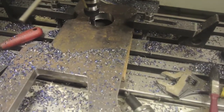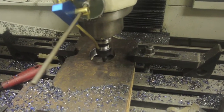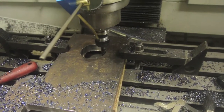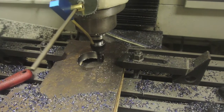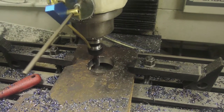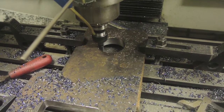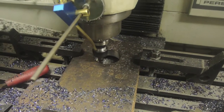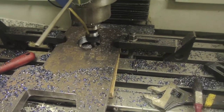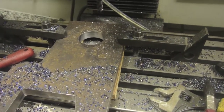That's the end of the hole being cut — it's just gone through the bottom. I always program it a little bit deeper just in case it leaves a few thou; it's often frustrating having to knock it out and file it all up. It's just touching the edges now, so I've gone around the edge once and I'll just do a clean-up pass after it. I'm not worried about the finish because it's rough anyway. The next job will just be to square it up a little bit, square to the column.